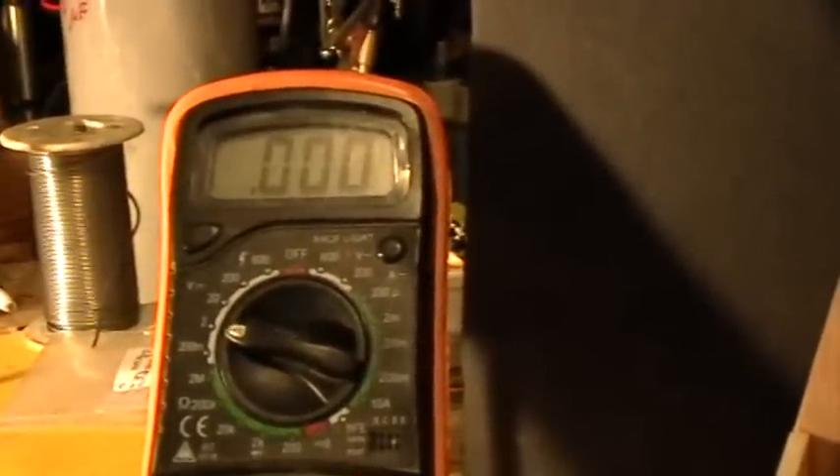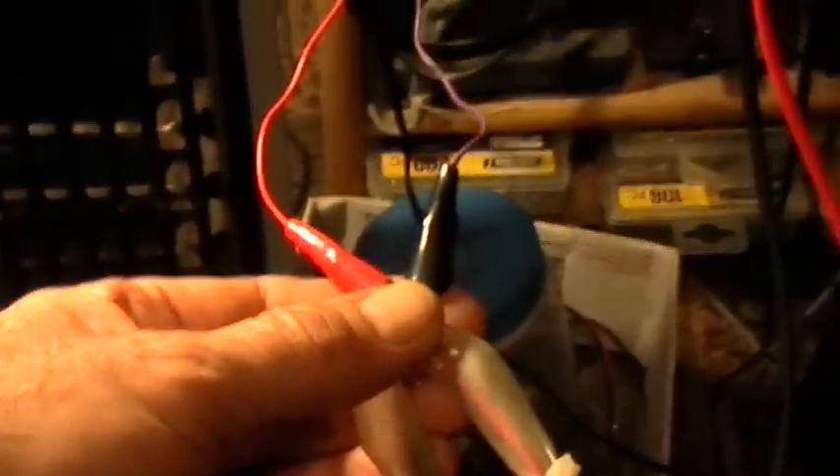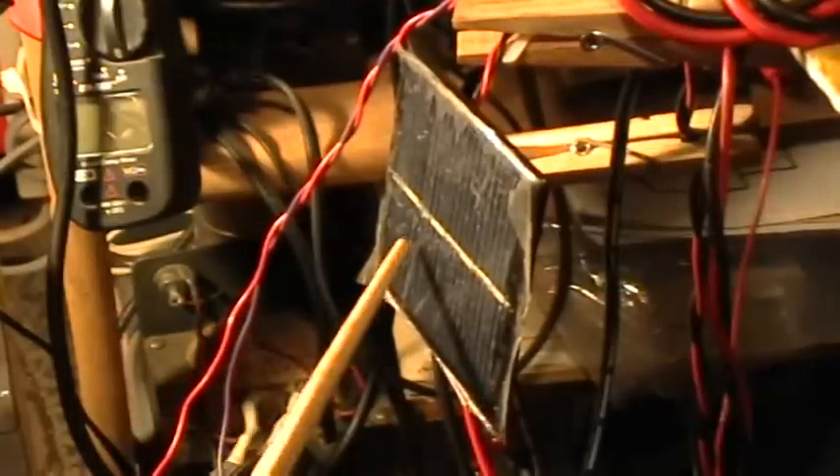And there's the voltage right now that's on the reservoir capacitor. That's happening because I've got the input leads shorted here. That right there is the photovoltaic cell — that's a 2-volt solar cell. And right now I just have the desk lamp there — it's not very super bright, that's a compact fluorescent 40-watt equivalent desk lamp.